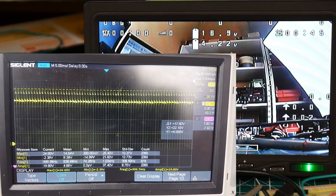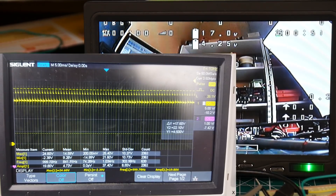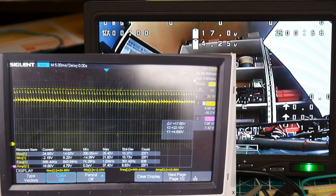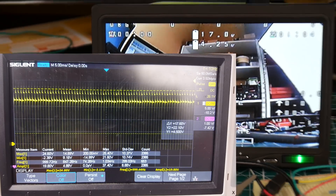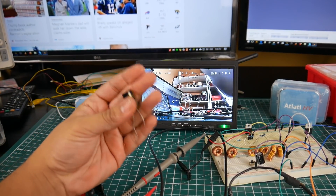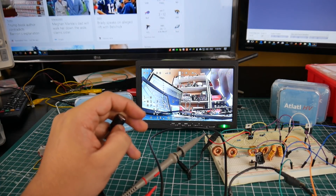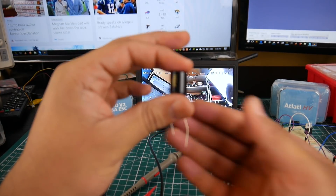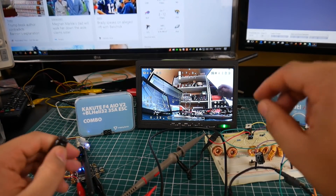The LC filter will clear up your image, but the low ESR capacitor seems to be the absolute winner, no doubt. Look at these drops — this is just insane. The low ESR capacitors are pretty damn good. I've also done a little testing as a sneak preview: I tested Panasonic versus Rubycon and they're about the same — not much of a big difference at all. I'll have that video coming later where we do a complete shootout with all these components.